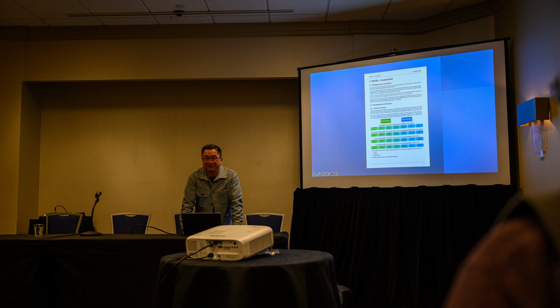Then it does MOS-D, distortion, nonlinearities, and additive noise. MOS-I, immersiveness, represents source width and source position. Reproduction of the signal's temporal structure, which is important for spatial perception of the audio signal. Comparison of spectral content in the upper mids, which is very important for human listeners. Binaural hearing model, two variants of differences between correlograms. This model qualifies the spatial perception of the human listener. And for this dimension, immersiveness in particular is where we see the use of advanced binaural hearing models that go beyond the human eardrum. We model both the cochlea fluids and hair cell movements to end up with neurological path predictions to create correlograms that are used in multiple ways to quantify the spatial perception of a human listener.